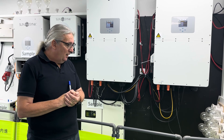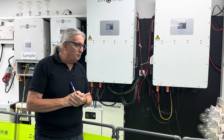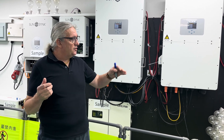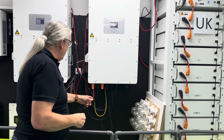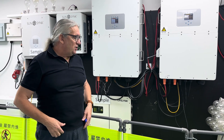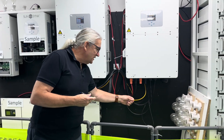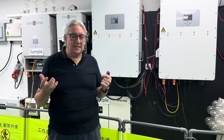One of the most important things with this type of technology is we don't have a common bus, because the voltages are very high. What we do is take the wire from one battery pack into the inverter, and from the other battery pack into the inverter. Communication is very simple — it's just a CAN cable, a single simple cable. The AC connections are wired in parallel.